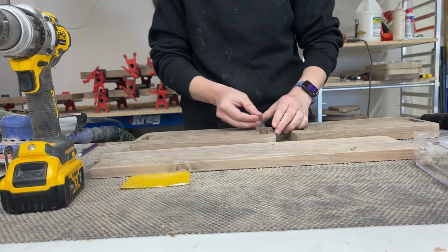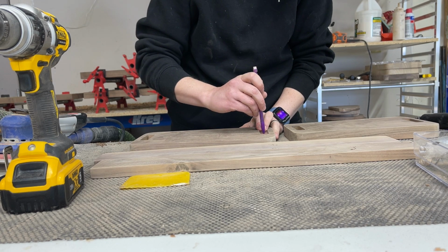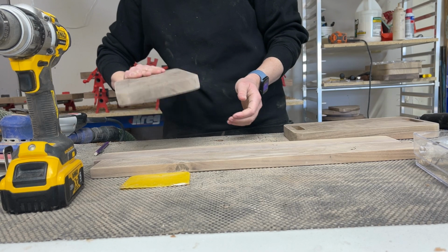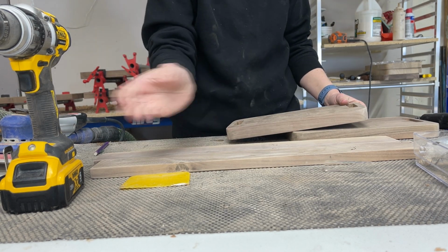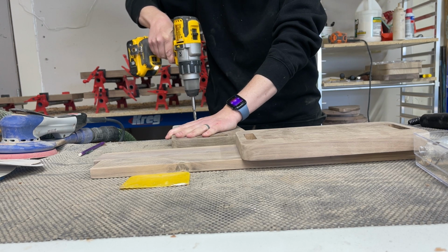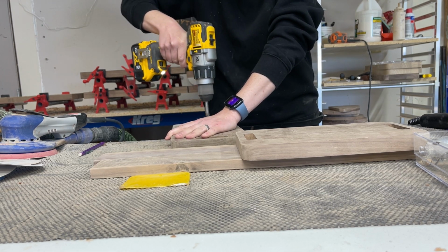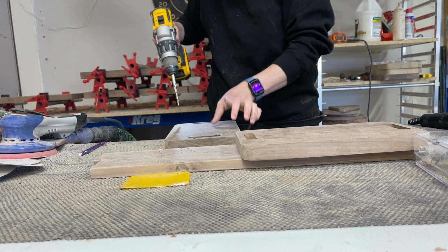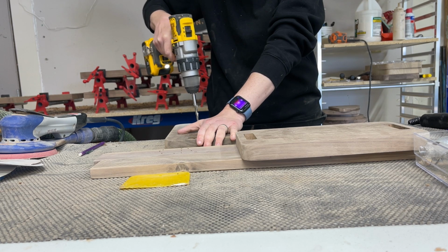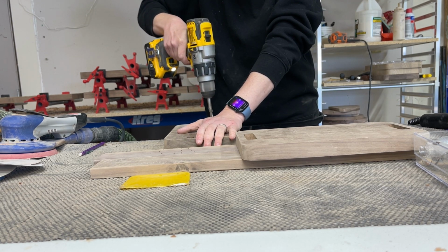Next, using the smaller acrylic template, you will pop that into your hole that you've chosen to use and mark in the dots. This marks your center, and you can drill these out using a Miller dowel bit, and then when you go to drill in your Miller dowels, you'll know exactly where they're supposed to be in the middle of the legs. I prefer pre-drilling this before assembly. That way it's a little bit easier once you have it mildly assembled.